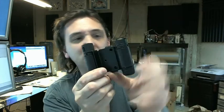The 1515 is representative of the series of hinge that this is, and that means it is for doors between 1-1/8 and 1-1/2 inch thickness, with a 42-inch minimum door height — they're saying if your door is smaller than that, the 1515 might overwhelm it.